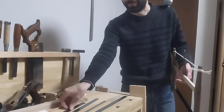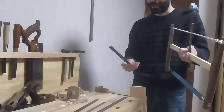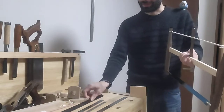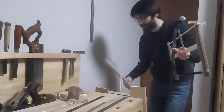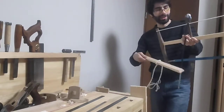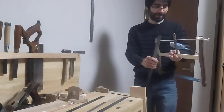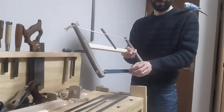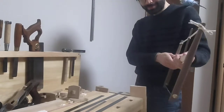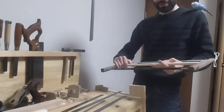You can get 0.3 millimeters, which is what this blade is, and this blade. And if you're making a short saw, so this is my longer blade, and I have a longer cross section here where I use this stretcher. Just change out the blade, change out the stretcher, and you have a different saw. But when you use a longer blade, you need perhaps a thicker blade, a thicker steel. But it works. It works quite well.